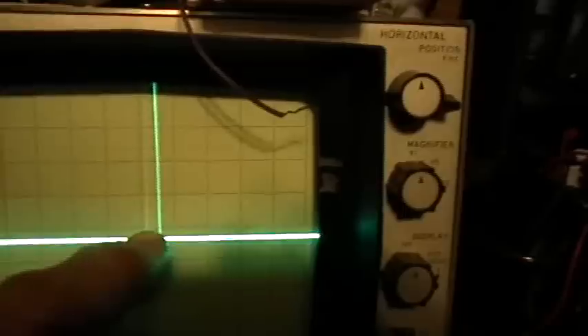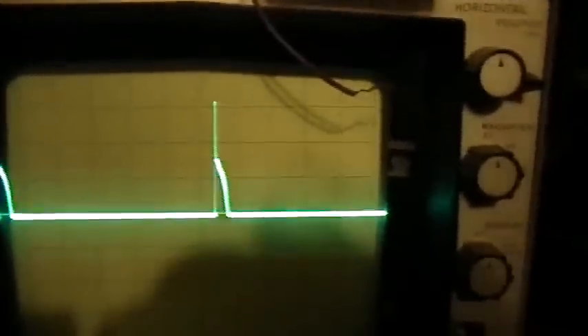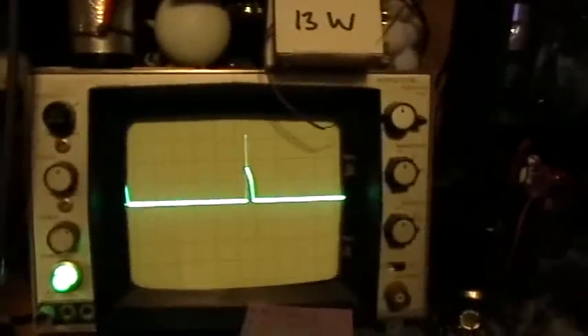Let's go back to DC coupling and change to greater amplification. When we go to AC coupling now, the signal has dropped down so that its average is on the zero baseline - and you've lost the information about the true voltages. At the setting where you can see the full 170-volt trace, you barely make out the effect - it's about one line-width - but at other magnifications it's very clear and easy to see.